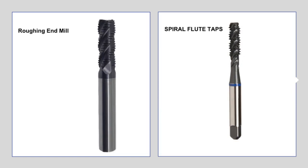These tools look similar but perform totally different jobs. A roughing end mill will remove large amounts of material and leave a rough surface — it will not produce a thread. Spiral flute taps can only produce threads and cannot be used to rough material to a given size. To identify: if there are four flats opposed to each other, it's a tap, not an end mill. If there are no flats, one or two flats, or a thread on the shank, it's an end mill.